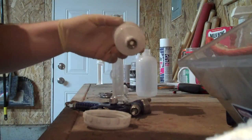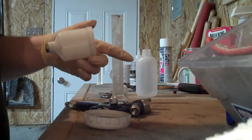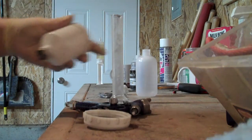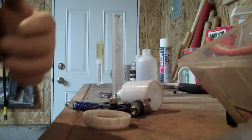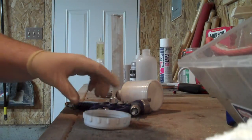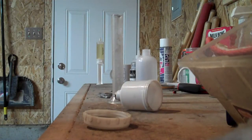And what you could use to make sure that you don't have anything that gets into your Cerakote mix is you could also get paint filters. And I do have those for the 100 to 120 grit contaminants, but of course I don't have them here, which is why I just use the shaker bottle. But you could use a strainer to make sure that you get everything out of there, but in my case I didn't. But that's what Cerakote recommends, is straining your Cerakote through a paint strainer. And they're pretty cheap. You can get them for about $5 for a pack of 100 of them at Harbor Freight. That's what I did, but of course they're in my trunk now and not in the shop. But you could use a strainer instead of the shaker method.